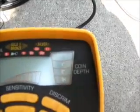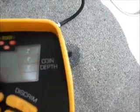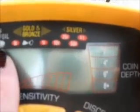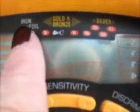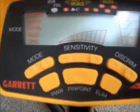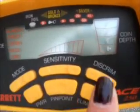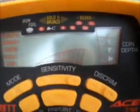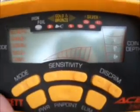I just really have a short attention span for reading directions — I kind of just like to jump in and learn it. But that might be an old pop tab. Do you folks remember those old-fashioned pop tabs, maybe from the 80s? Here is a glass bottle top. It also identifies what the item might be made of, so that's helpful. Depth reads 2 inches, 4 inches, 6 inches, 8 plus. And sensitivity — we'll be able to set different sensitivity levels. There's also power, pinpoint, and eliminate. Mode and discriminate — so with eliminate, say if I want to eliminate all those pop tabs, when it gives me that particular signal I can eliminate it, and in the future it will not tell me it's there.